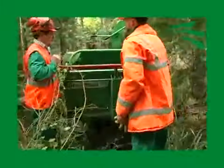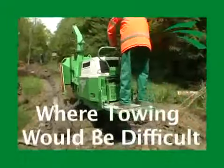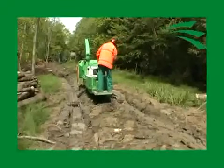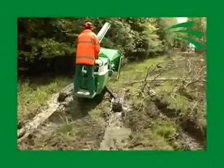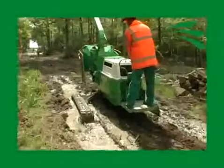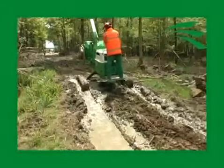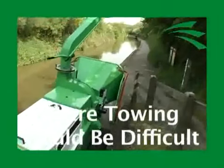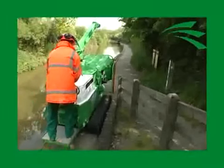At 1320mm wide and weighing only 1800 kilograms, this machine exerts a ground pressure of only 0.26 kilograms per square centimetre. The machine's features include a bottom combined safety and control bar mechanism, no-stress engine control box, permanently tensioned drive belts, and as an option, an electric winch with remote cable control can be fitted. Display technology is fitted as standard.